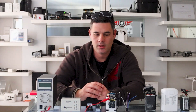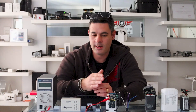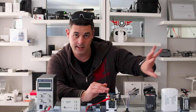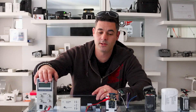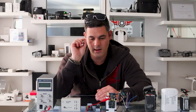If all your cells are at voltage you will be able to read the battery. If there's one cell that's no good anymore — bin it, simple as that. One of the main errors guys encounter — yes it can be a quick fix depending on the state of your battery, but about 80% of the time this is the route we have to take. Trickle the voltage in, get every cell where it needs to be, then read with your CP2112.